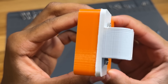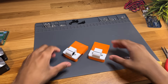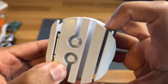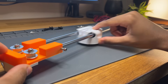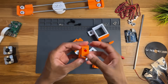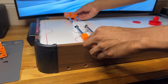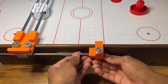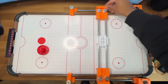It turns out I didn't leave enough clearance for some of the fasteners, which made tightening them a massive pain. But after some trial and error, I managed to finish the pieces that connect the Y axis to the X axis, designed to hold a set of pulleys to change the direction of the belt. The carriage itself moves up and down along some linear rods. For the X axis, I made some simple mounts for the stepper motors — everything connected via M3 screws — and some clip pieces to guide the belt on the outside. Once the table is added, the Y axis goes on top, the steppers go into their mounts on the sides, and some additional linear rods are put in place so I can move the carriage in all directions.